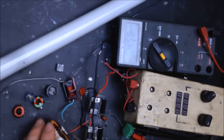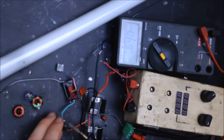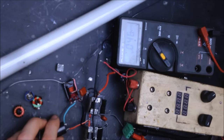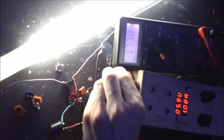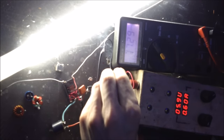Let's pick out a different inductor and see if we can get a cleaner, better signal. So, I'm just going to step down in sizes. So we got this inductor. Pop that on, see what happens. That's it. So right there, 1.2 amps, 17 volts. See how the voltage is? Everything is pretty stable with this inductor. This would be totally suitable as well. So turn it back on.